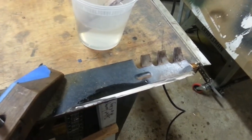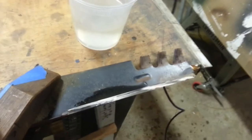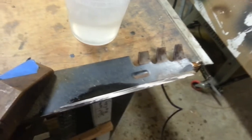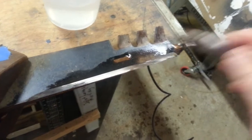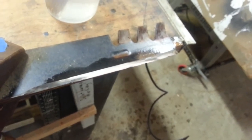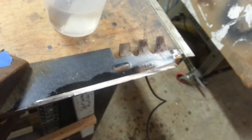When you're grinding and you get down to where you're finished, be sure you always have some water on hand — get the water before you start grinding. Nice cold water. You can even use a better quench mix; it cools it faster. So you just quench it hard, because you don't want it to cool off slowly. You want to quench it so it stays at some hardness level on the edge. It's not like tool steel or anything, but I'd imagine it's at least medium grade steel, so you should be able to get some hardening with a little quenching.